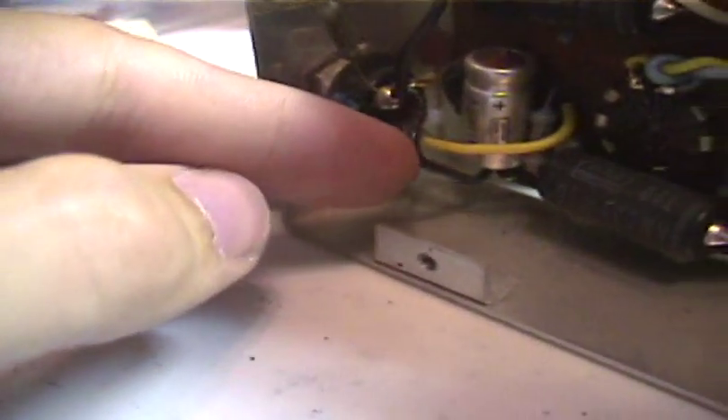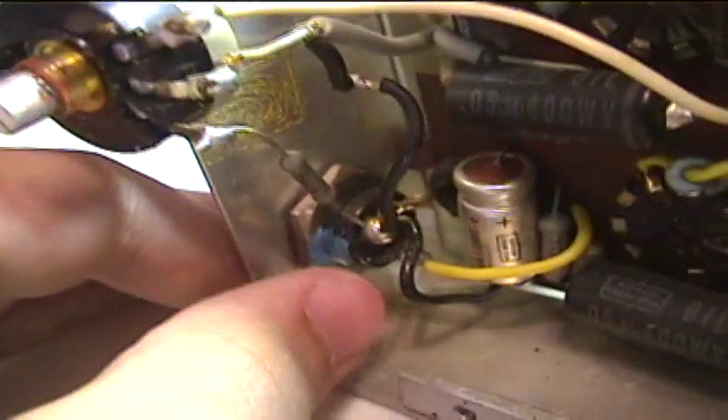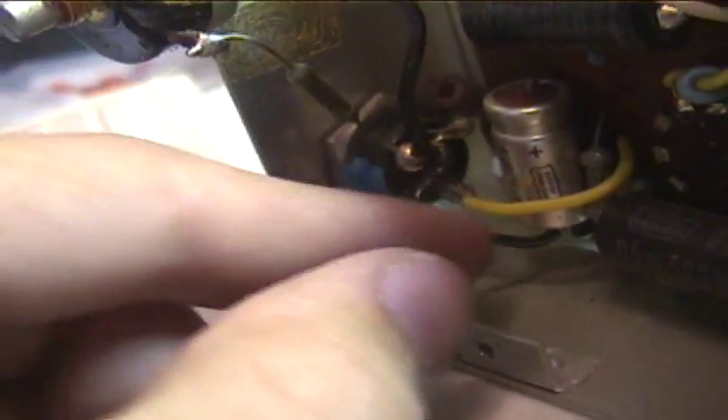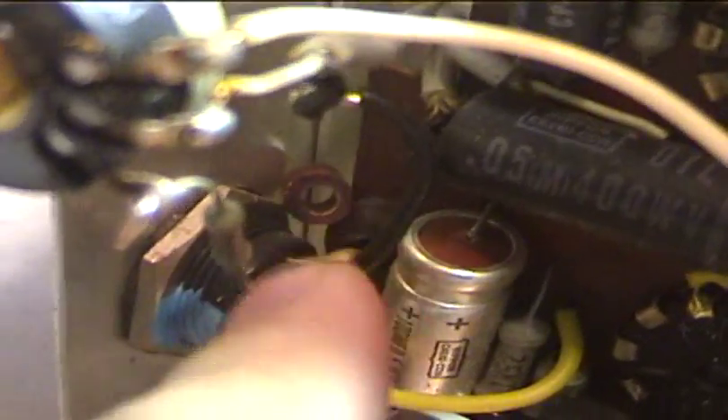One important thing here is this part right here, which is the play head output — actually, no, it's the input. This resistor goes right on that lead. On that lead also goes this black wire, and this other black wire here. The yellow wire goes to the bottom part. Those two top parts are connected together to the part that goes to the resistor and the two black wires. Also be sure not to lose the small little spacers — that little brown circle thing down there. On the other side of the mic and line input jacks is another orange washer that goes on that side.